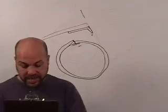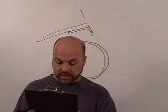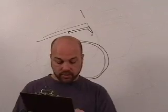It works fairly well. Also, when I know I have a plate that is not as long as my tape, 18-inch rolls, I don't cut a gap at all. For example, if the plate is 15 inches long, repeat is 22 inches, I would normally have to fill in the gap. This is something we didn't cover yet. All I do is figure out the placement of the plate on the cylinder, mark it, cut the plate, that's it.